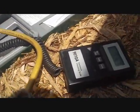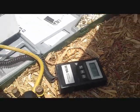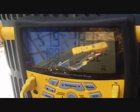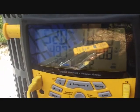You can see it was barely moving before, now we're up to 12 ounces in a matter of seconds, so that's a lot better. The charge was pretty deficient. We started out with a superheat of 70, and we're going to be moving downward toward 22.